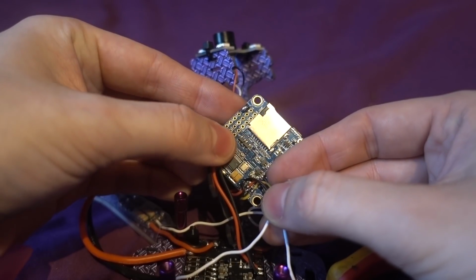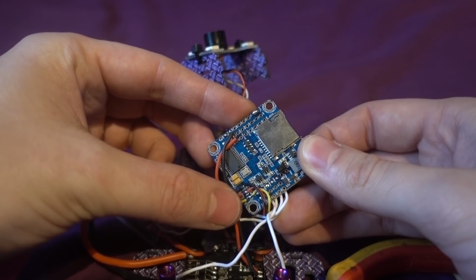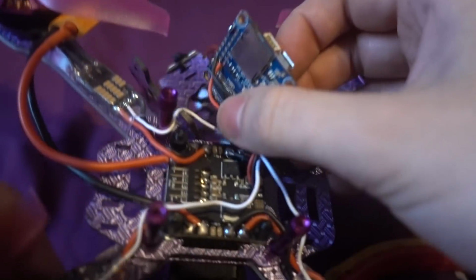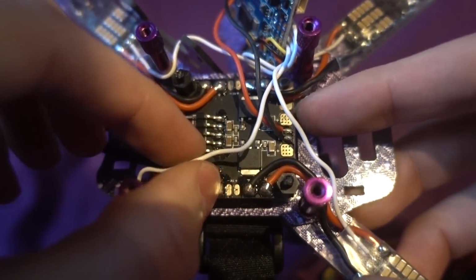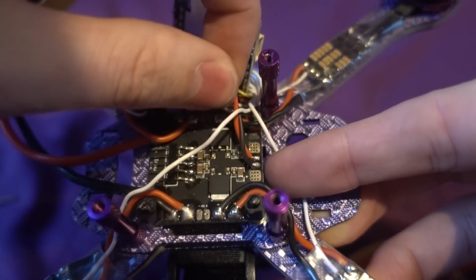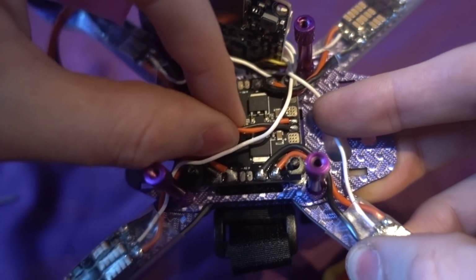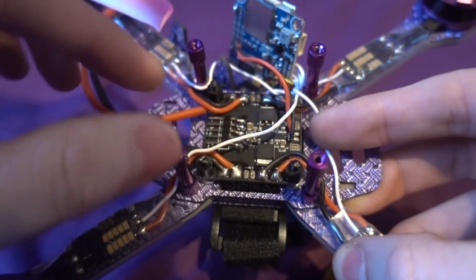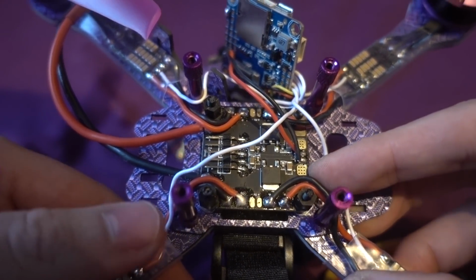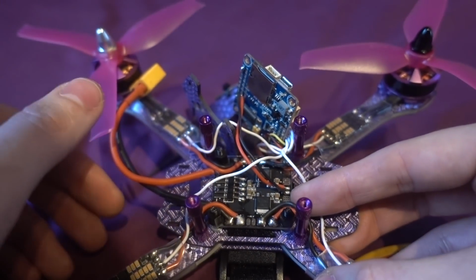So it looks like this is where all the camera is going in, and we've got a common ground, so that's nice. So our on-screen display should show properly, and then this is the VBAT. And then underneath here, this is interesting, it's the power distribution board, and I've just noticed the problem. They've soldered the VBAT up to a regulator. VBAT is soldered up to 12 volt. And that's not right, because that means that the on-screen display will always show 12 volt. Oh dear.